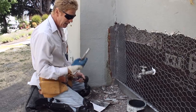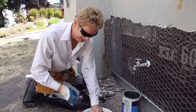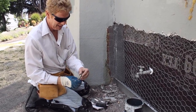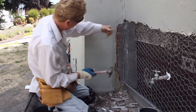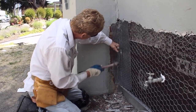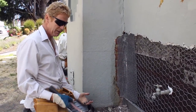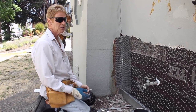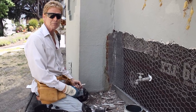Here's a new one — this one is not pitted, so the nail will hold on easily. What I like to do is go into the grout, right here — boom, you're in. That holds you. It doesn't take a lot of strength or effort. And those power guns — ramsets — forget it; I feel like you're in a western movie. Makes a lot of noise.